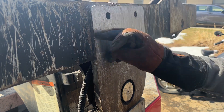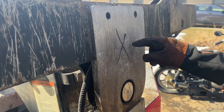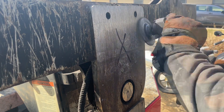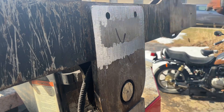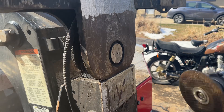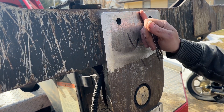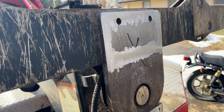First things first, I'm going to clean up an area here. I'm not going to plate this whole thing with AR500 - just where it's wearing. This area isn't too worn, but this plate down here is actually far worse and the bottom one is definitely not in good shape. For this initial grinding, I'm just using a hard rock. I prefer it - it removes more material than a flap disc. I generally use a hard rock as a first pass and then buff it with like 80 or 60 grit flap disc just to get any sharp burrs off of it.